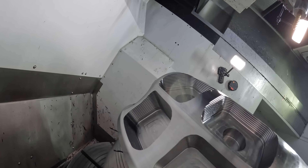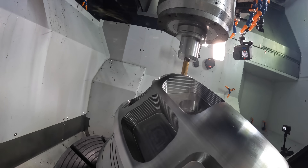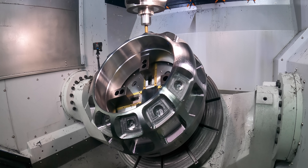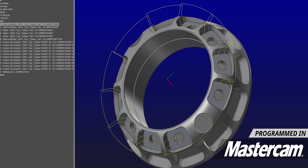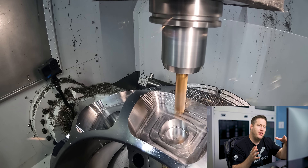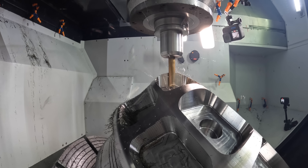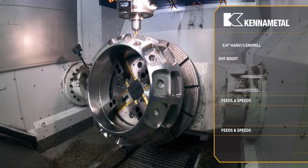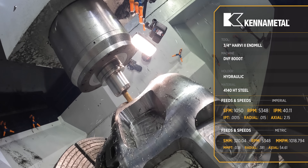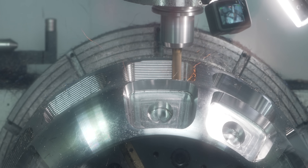To finish this we're going to use a Harvey 2, which is a 5-flute end mill, and see what kind of finish we get on these pockets. Now all of these pockets have tapered walls, so we're going to have to swarf mill everything. Technically there's a big enough corner radius that I could use a 1 inch tool — the same as I roughed with — but there's not that much room, so it would have to do a very small arc in the corners requiring a huge rotary move to keep up with that feed rate. So I'm going to step down to a 3/4 inch tool to finish these pockets. That way we get smoother toolpath in the corners and maintain our feed rate.